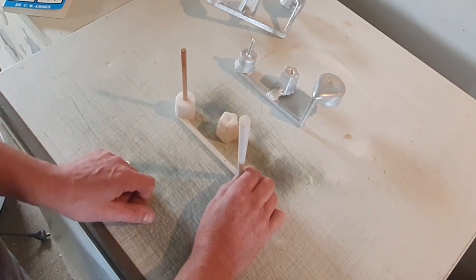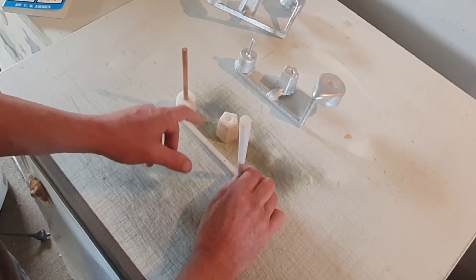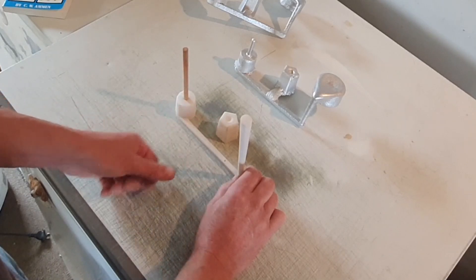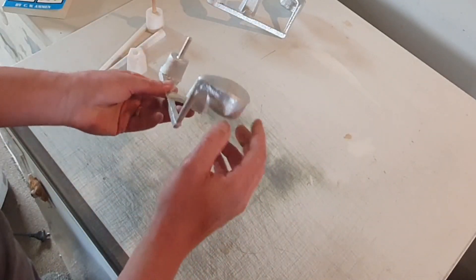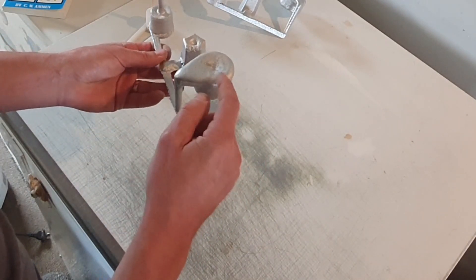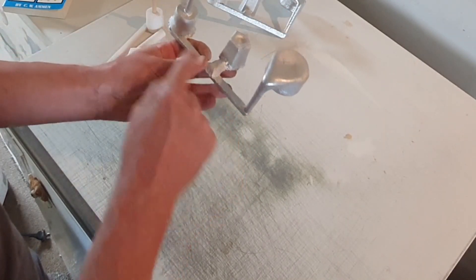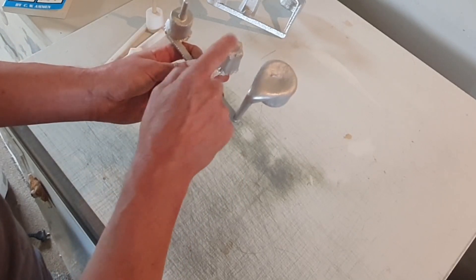On that pour it worked really well, but there are so many different setups of gating, runners, pouring holes, and sprues — it's a huge topic and can get quite complex. We've also got a pouring basin: when we pour the aluminium in, we pour it into the basin first, it comes over a ridge then down into the pouring sprue, straight across the runner into the spin trap, and then fills the gate and the part.